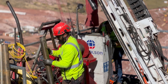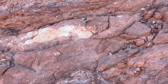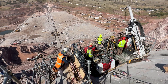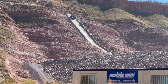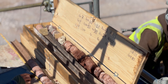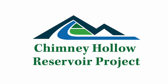Grouting programs for large dams are usually the hardest part to estimate because of ground conditions. What works in one area may not work in another — the geology can change. You do investigations and you learn pre-construction, but ultimately you don't really know what you have until construction starts. You have to be systematic; we're trying to grout the foundation to a standard and in order to do that you have to be systematic and consistent.